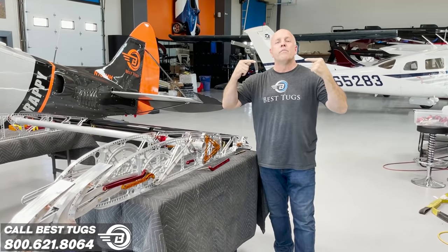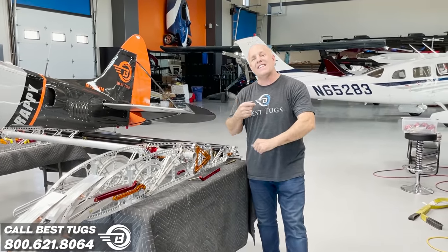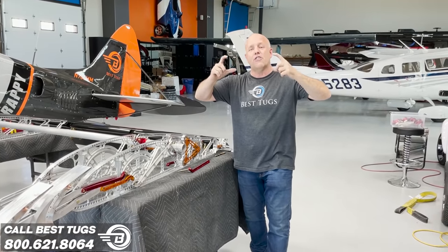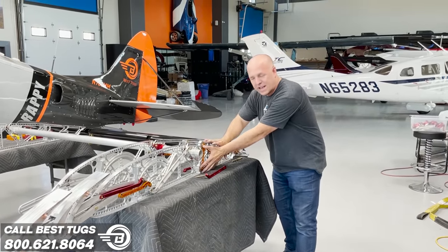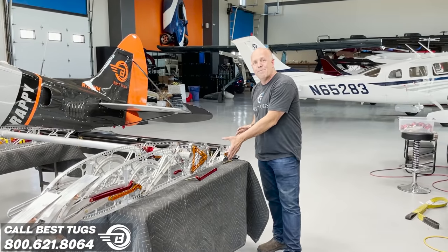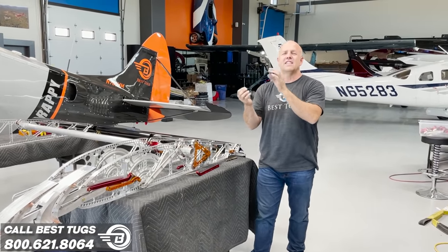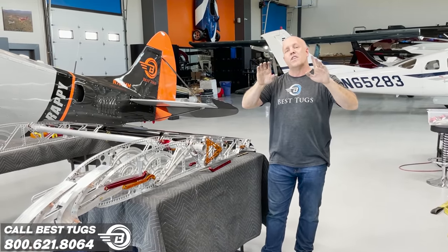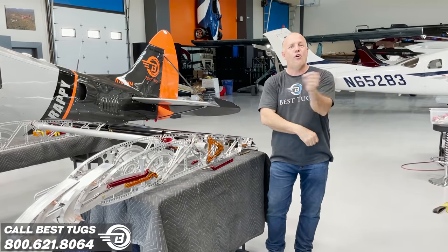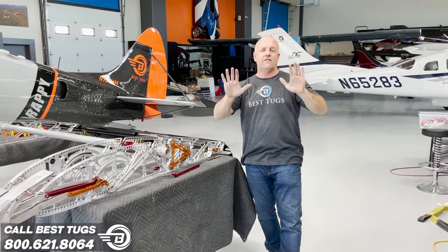As it rotates, the cables shorten on one side of the aileron controls while lengthening on the other, and they're doing it together, which allows both ailerons to droop, all in one tight little mechanism coming back to a pivot at the back. And both of them are drooping together, but your stick never moves. So as this changes the length, never changing the length of the cable, of course, just lengthening the one side and loosening the other to allow a droop, the cables can still spin back and forth with your stick and get 100% aileron control at 25 degrees of droop.